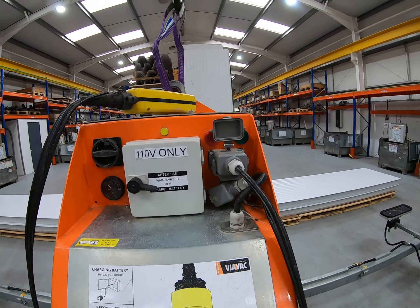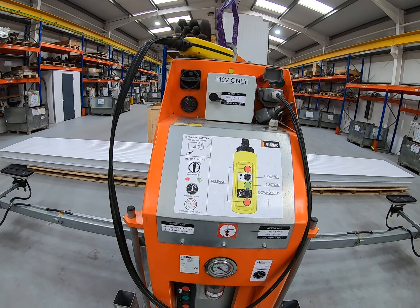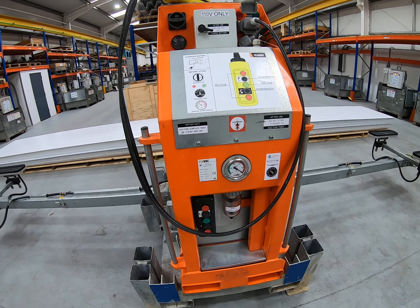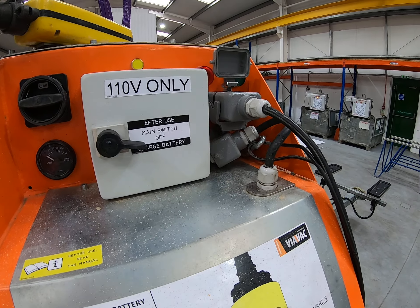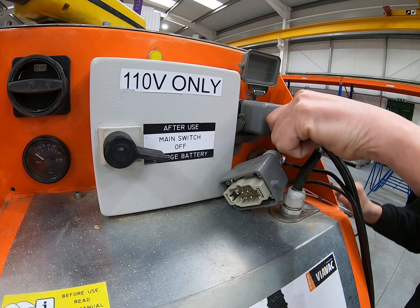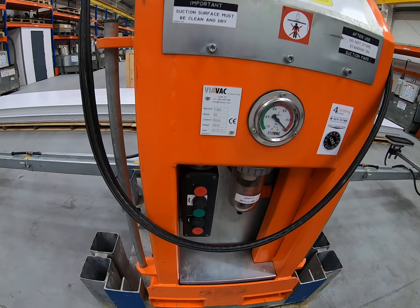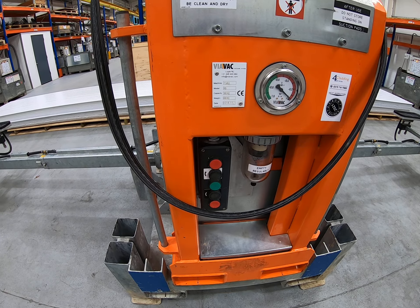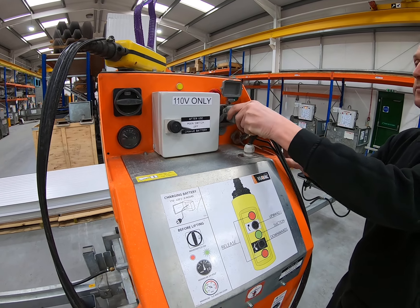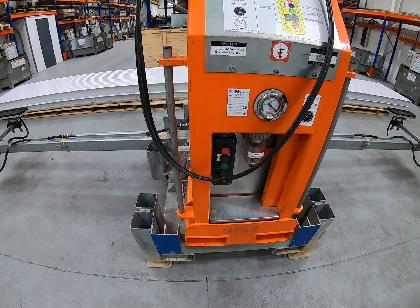On the top here you've got a set of control pendant buttons, and also on the front of the machine you've got a secondary set of buttons. That's in case you have a problem with the control pendant and crush the cable. To switch over, Neil will show you — just disconnect this plug here: push the lever backwards and pull the plug out, then reinsert the alternative plug. That means the buttons on the front of the machine are now active and the control pendant is redundant. We include this because we've had occasions where people have crushed the wire on the control pendant, and rather than waiting for the machine to be repaired we have this alternative set of buttons on the front.